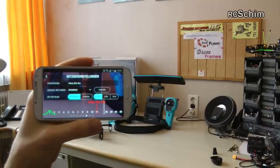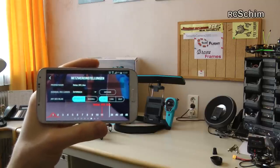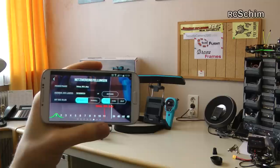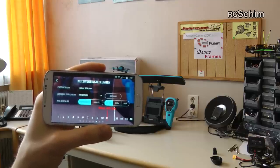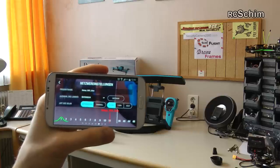I put the link in the description where you see the different power settings with different countries, and I read that on 2.4 gigahertz and US setting you get 400 milliwatts of digital power, which is quite a lot, and on 5 gigahertz they even tune up to 4 watts, which is incredible power setting, I'd say.